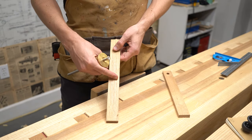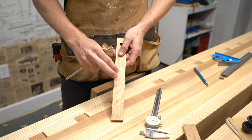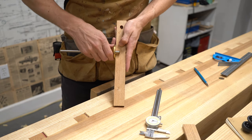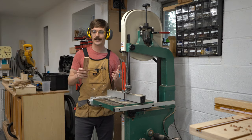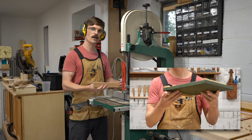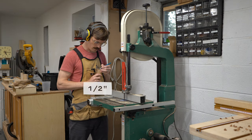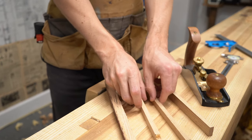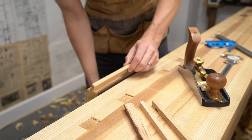For the piece used for the angled stop blocks, I'm going to strike a line at three quarters of an inch, and for the strip that holds the sharpening stones in place I'll strike a line at half an inch. When pieces get small like this, I prefer to use the bandsaw. The last piece to cut is the wood going underneath the angle setting jig so I can push it against the table — I'll guesstimate around half an inch. All edges coming off the bandsaw will be a little rough, so I'll smooth these up with a few passes of my hand plane.